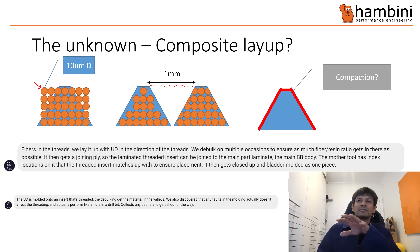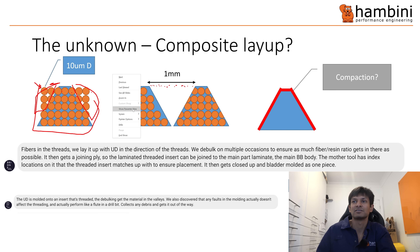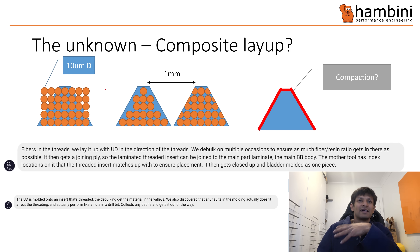Now there are a few ways to do this. I'm not necessarily saying this is the way Bridge Bicycle Works does it — they've got a patent going on and I don't expect them to go into every detail for commercial reasons. You could have lots of material and then cut them away and fill the rest in with resin — but the problem is you'd end up with cut fibers on the end that have a tendency to fray. Bridge have said they mold the fibers into the thread so you don't have that cutting. These are the statements they made — I have copied them verbatim. They contacted me on Instagram to say that.